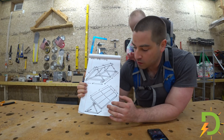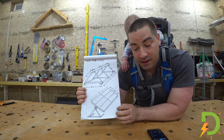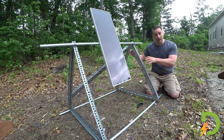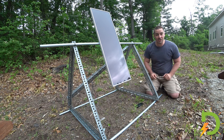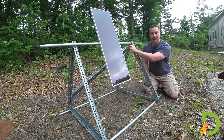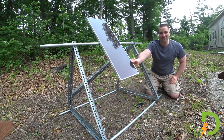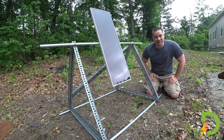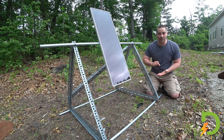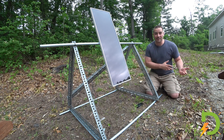Six panels in landscape would wind up being about 13 feet by 10 feet, so I would actually need two of these lined up side by side, which would be about 26 feet long in the backyard. Here's a model of my idea: a triangular-shaped frame built from the Z-channel, with two pontoon-style bases made from the five-inch galvanized pipe and one across the top — also that big five-inch pipe. The solar panels could tilt for different times of the year, and this whole thing can be done without an excavator or pouring concrete. It's temporary, and when I'm done I can unbolt it and take it to the next property.